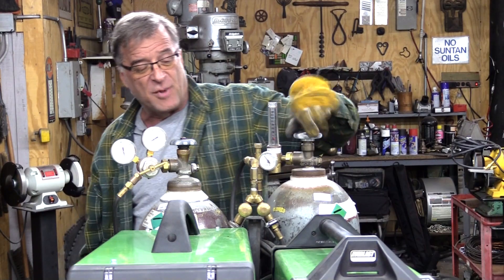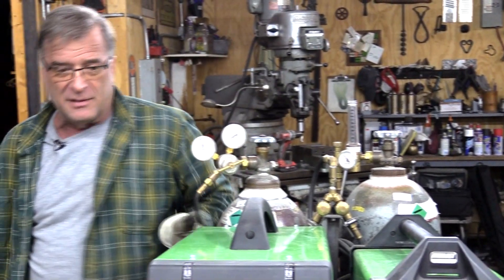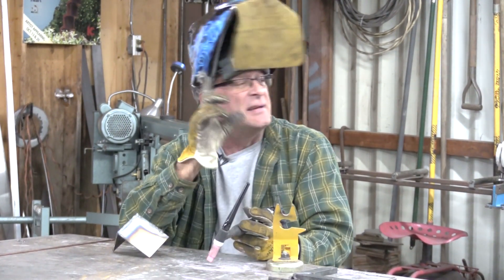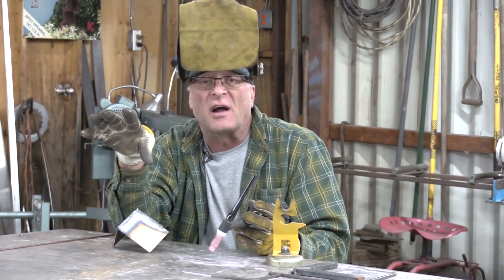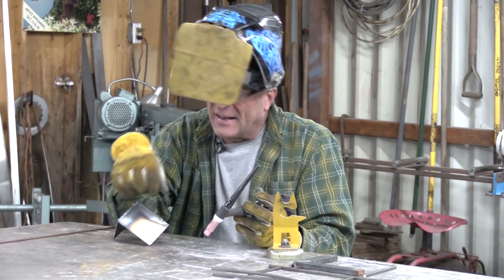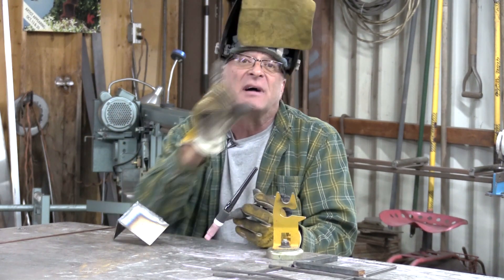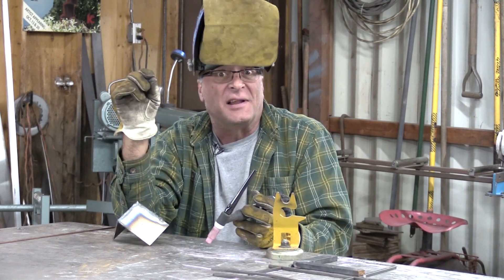So let me just turn on some argon, open up the splitter. I've got the welder running, all set up on TIG, set at 130 amps. And I'm just going to run straight argon, just like I normally would, and let me just run a little bead so you can see how that looks. And then we'll stop, switch the gas over, and run another bead. Oh boy, you're going to love this.